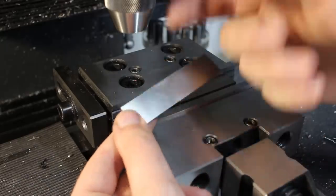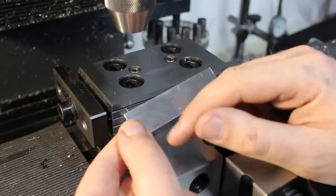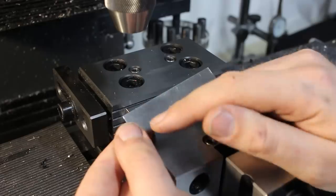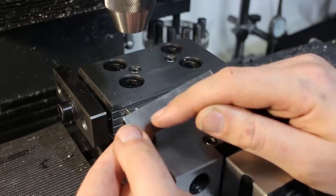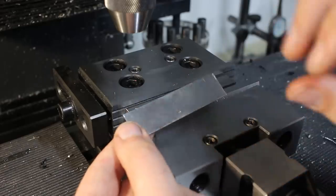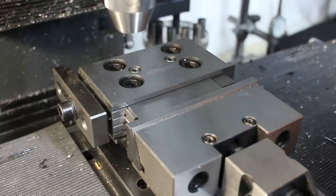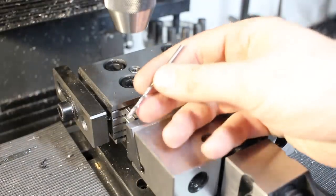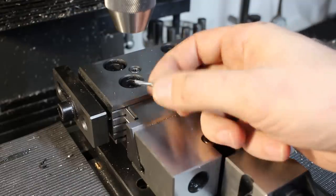Drilling with a carbide drill works perfectly fine — no problem. I also like to use a carbide ball end mill to drill it, which leaves a very precise, very clean hole. But sometimes you don't have that. Sometimes all you have is a high speed steel drill with no coating, probably dull already, so you have to regrind it.